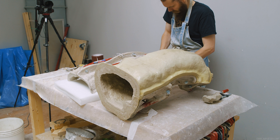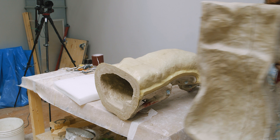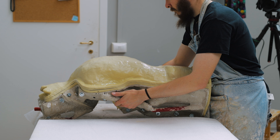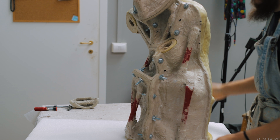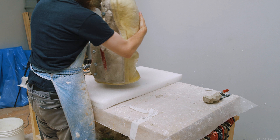I'll lift the mold upright on top of the packing foam and have it sit upright. You want to be a little bit careful with the bottom of the cast right now, because there's a lot of weight it has to carry since the front half of the mother mold is still on the piece. Since the back half is off, the entire back half of the base is free, and the casting inside, if you lean it on that back edge, has to carry the weight of the mother mold and the casting.